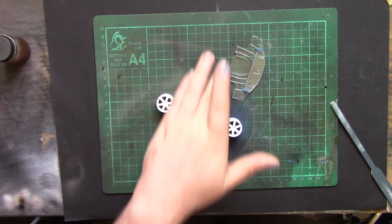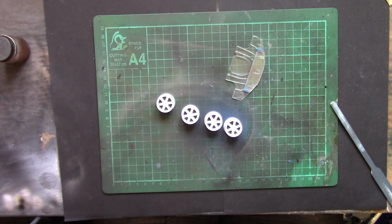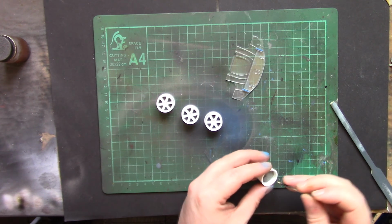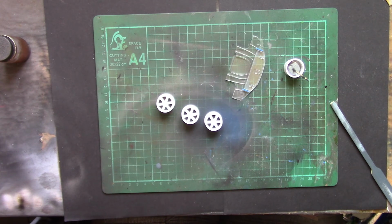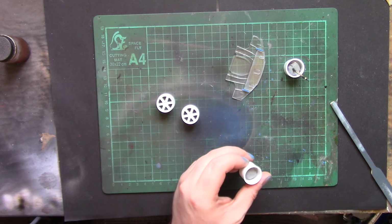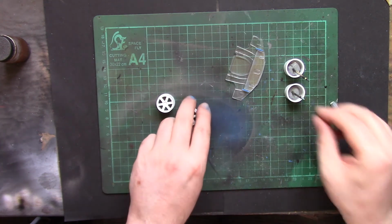So that needs painting semi-gloss black. They need painting white. I know, seems silly. They're already white. Why paint them white? The paint is a better finish, to be honest, and all I'll get, it will be probably a coat of grey UMP primer and a coat of white UMP primer over that. The reasoning for that is that with the grey you can then see you've painted everything. Strange, I know, but you do kind of need to paint the whole thing. And the same with the white going over the grey, as you can then see, again, you've not missed any bits.